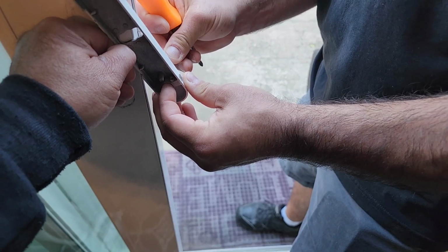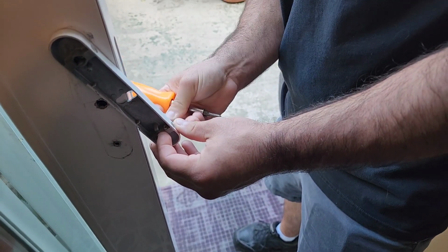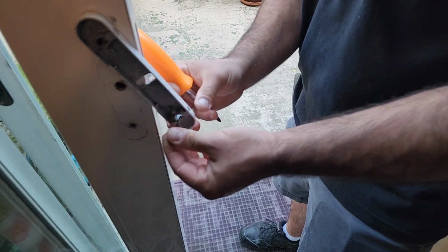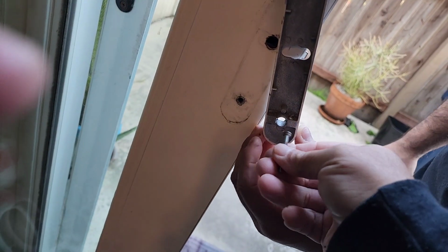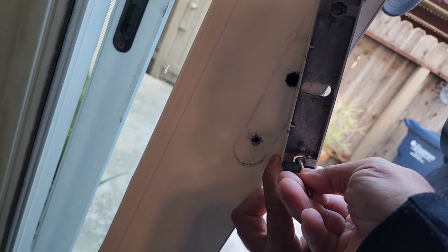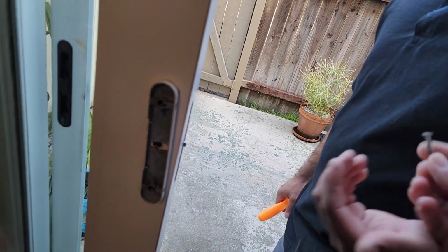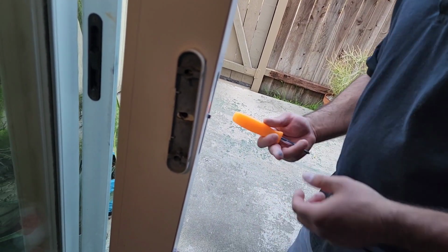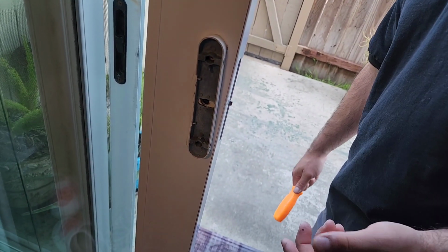It holds. It might have just been jerked hard. Oh, it holds, right? Oh, it comes out. It's just an angle. Okay, then let's try to get a little washer, no bigger. Let me see how big that head is compared to the hole. Okay, look, you can see you've got like 3/16 of an inch. Let's get a washer that's slightly bigger than that head. Let's go see what we got. And then we'll be able to use that same screw. We're gonna go to the truck and get what we need.